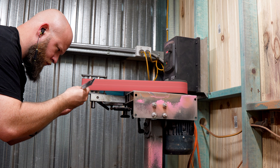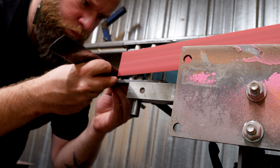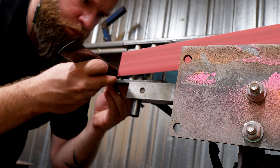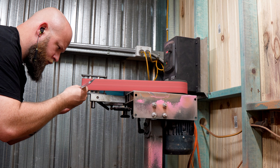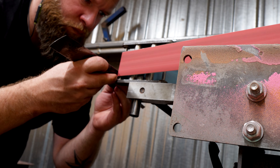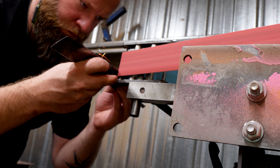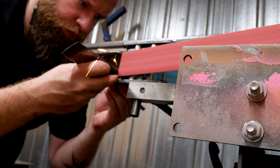While I'm grinding away here let's talk a little about serrations. You don't want to cut these very deep — think of them more along the lines of little scallops in the side of the blade. If you cut deep wild looking teeth your knife will be inclined to tear everything apart and give a really poor cut. But the smaller you make the peaks in your teeth the smoother the blade will perform. Think of it as a little zip on your knife's edge. All we need is a little bit to get it started and then the geometry of the blade will do the rest.